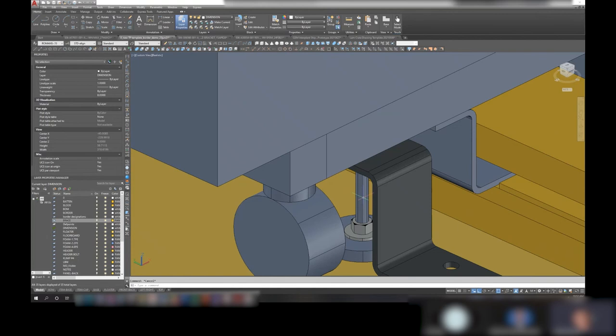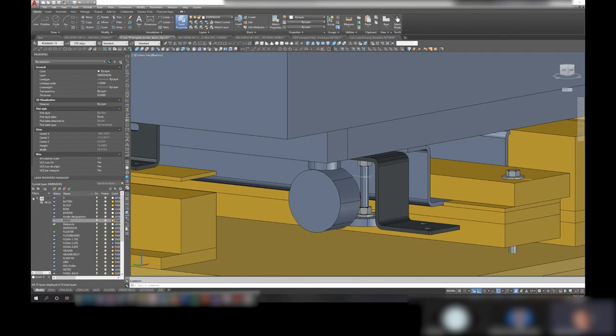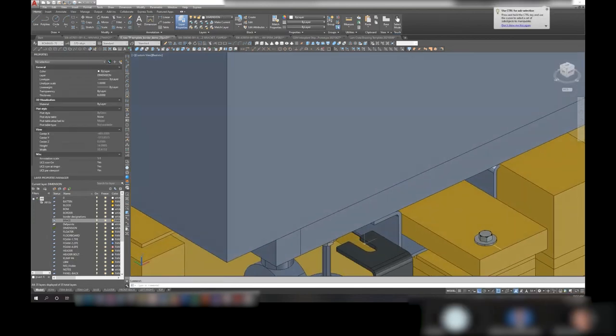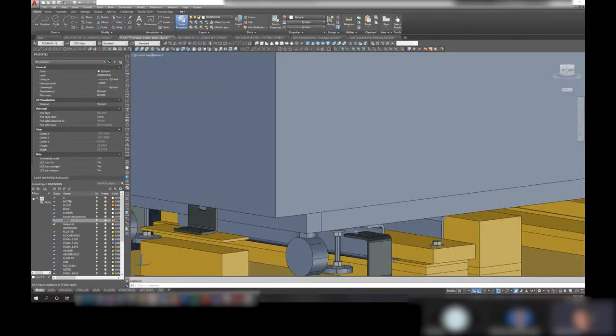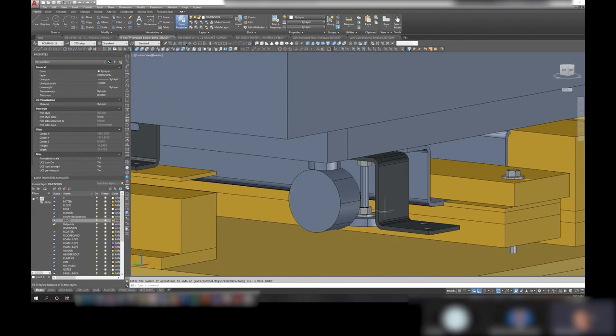So if you want to use a foot mount, you will need to know the diameter of this, because of the bracket slot. The opening of the slot, this one you need to control. You cannot make it so big that this one wobbles, with so much clearance also cannot. So unless I have no choice, then I will make the bracket.